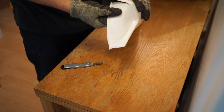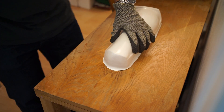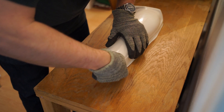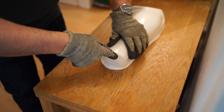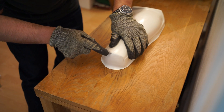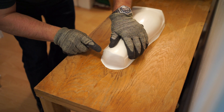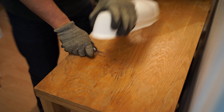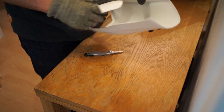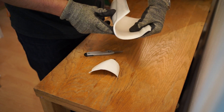And then the simple score and snap. Let's get rid of that piece and then do the other end. Take it easy and slowly, because knives can slip a lot on ABS plastic. Always push in and push through that last section. Bend and pull — you have a nice cut line. Very easy, very quick.